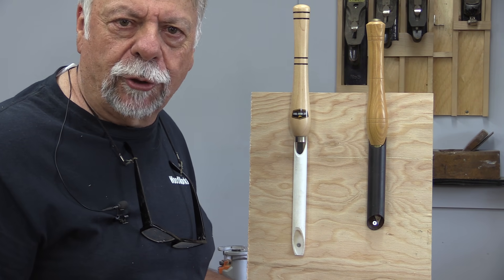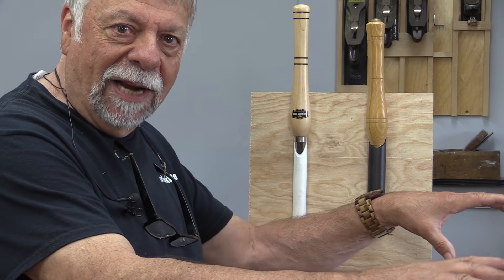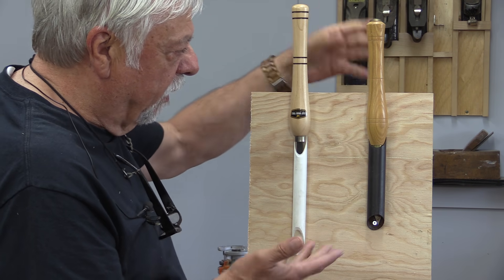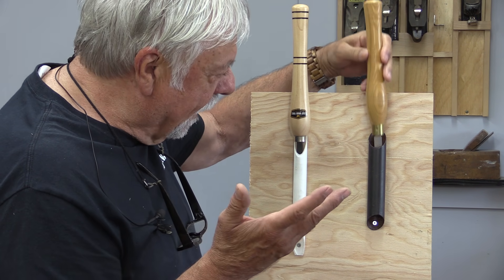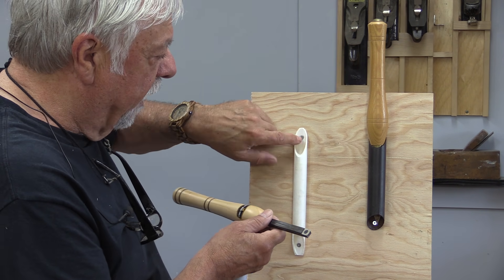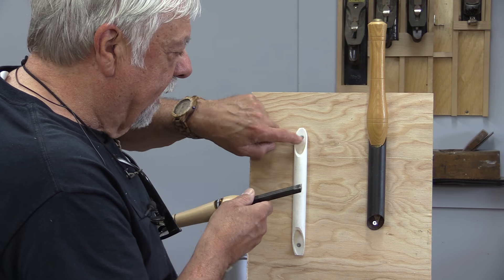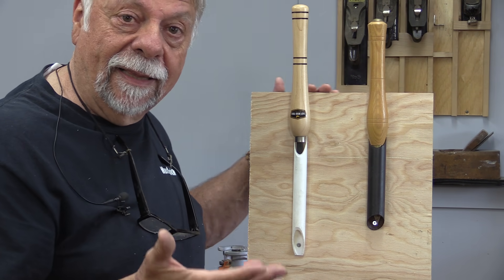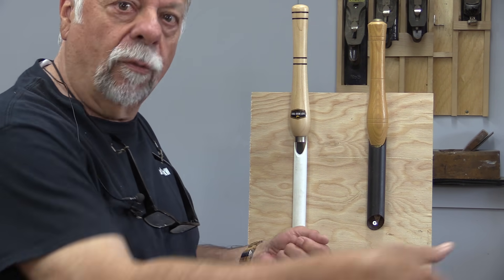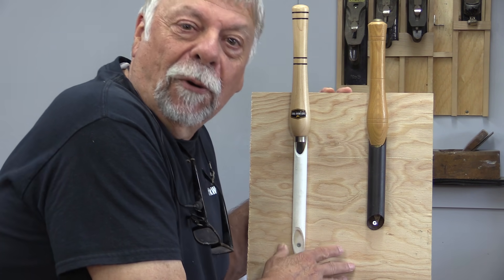This tip is something I saw at Rob's shop. Rob is a turner, and right behind his lathe he has these little plastic tubes — a series of them — and he puts his tools in there. It's a great idea, quick and easy, inexpensive to do. I've got a couple of tools with carbide tips on the end, so if you do this, probably a good idea to recess your screws because you don't want to touch that carbide to anything steel or you'll chip it. The thing about turning is you're always using a tool — in his case, he can just put the tool back and grab another one right away because it's right beside his lathe. I thought that was a really good idea, so I borrowed it from him. Thanks, Rob.